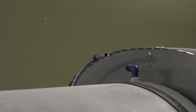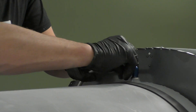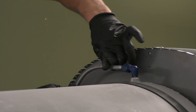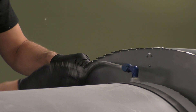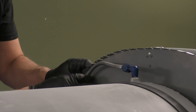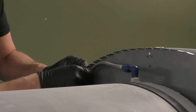Now I'm going to go to the other side, grab the nut, bring it up, get this attached, and then do the rest of the shaping of the tube. This doesn't need much force on it at all, especially since it isn't bent. Either way you should fit your fittings the same way regardless of how you plan on using them — whether it's fuel flowing through it or vent, assume it's going to be fuel. Got the line pretty much where I want it. That will work quite well.